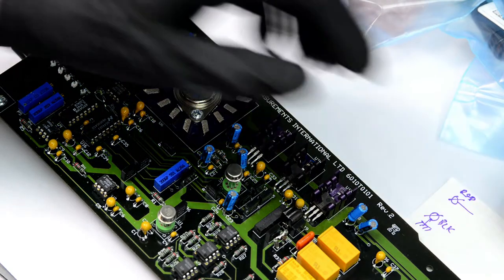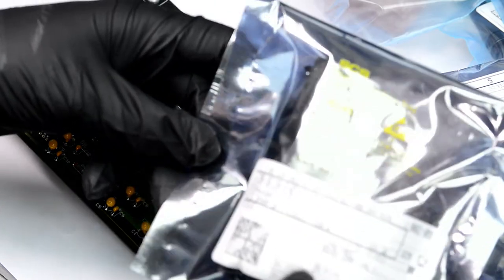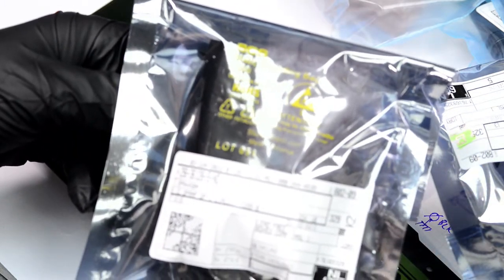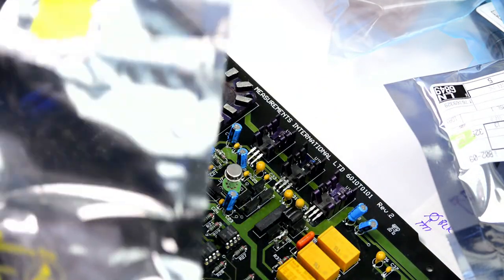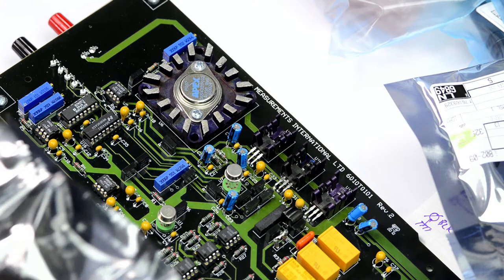So I bought new replacement opamps. Here they are. They are each around $15 or so. So I bought a bunch of them. Actually, the same opamp is also used in the 5720 Fluke calibrator. That's why I'm a little bit familiar with these guys. So we'll be replacing the opamp and then replacing those resistors.